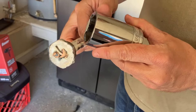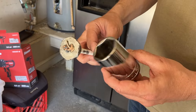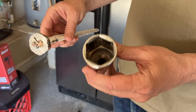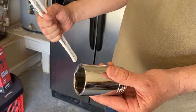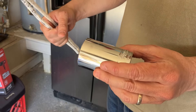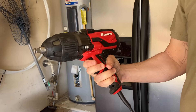Next, I needed an impact wrench because my drill wasn't powerful enough. Try your drill first — if you have a powerful drill it may break it free — but because the element was locked in with lime, I just didn't have enough power. So I needed an impact wrench, which I didn't have. I went to Home Depot and bought the cheapest one — it wasn't strong enough. So I ended up getting this big daddy.